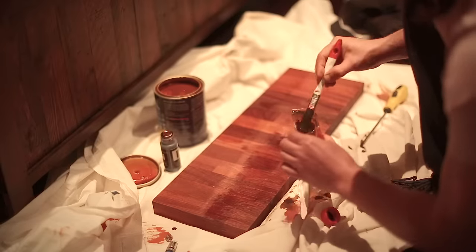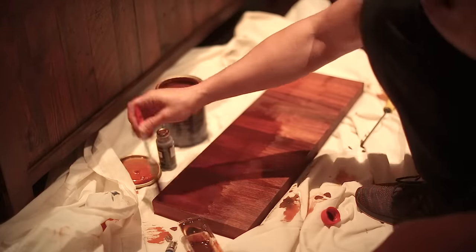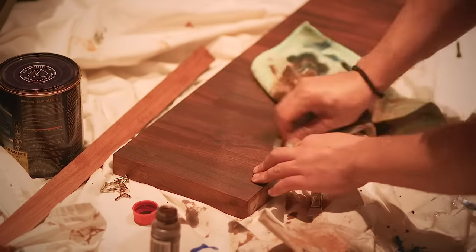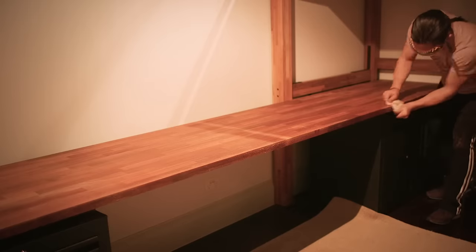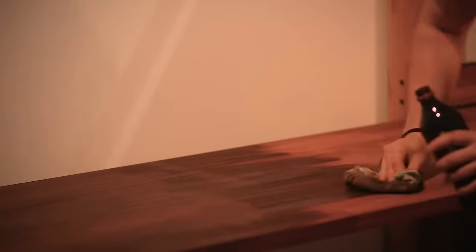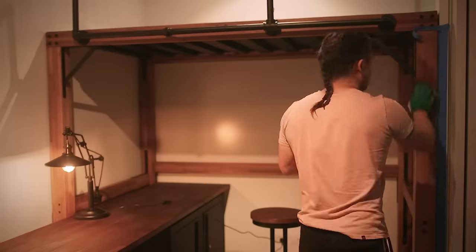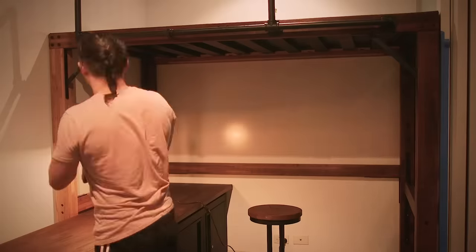Time to experiment with some stains. My main concern was the orangeness of the timber. I visited a craft shop and bought a cheap tube of blue watercolour - blue being the opposite of orange. After a bit of trial and error, I found that the right mix did actually reduce the orange hue of the timber while still preserving its rich grain. Time to sand the edges of the desk and apply coat number one - a mixture of walnut stain and blue watercolour - and then coat number two, which is mostly just blue. And then the same for the loft. I probably could have done this before it was all assembled.